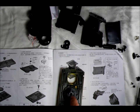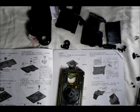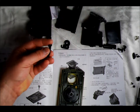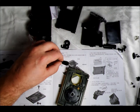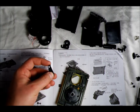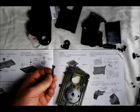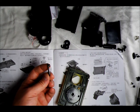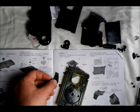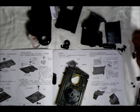The first part of the shutter assembly is done. Now we need the shutter blade itself and spring B. The shutter blade looks basically like a clown tie with a hole at the top and then a small hook in it. The assembly has some depth to it — that little part protruding out will face the front of the camera, and the hook is aligned to grip that way. We're going to need spring B.